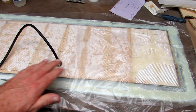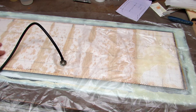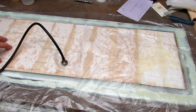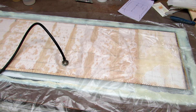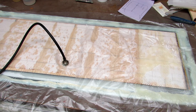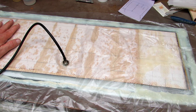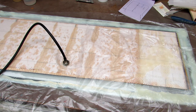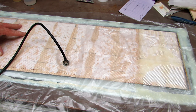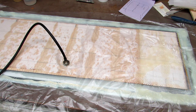You can see how the resin has soaked completely through most of the balsa and the peel ply. I clearly have way too much resin on this, so I will still end up with some good usable plywood — it just won't be as light as it could be. It should still end up being lighter than light ply and probably stronger, but we'll see. This is my first batch — later.